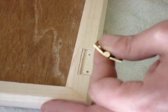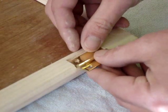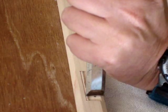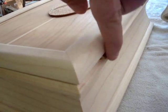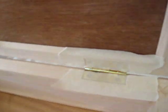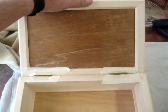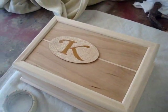I decided to revisit these hinges and see if I can make them work. What I'm doing is carving them out a little bit deeper inside so that they'll fit in like so — I think that might give me a better chance to have the lid stay open rather than flopping back. These hinges really should be flush with the back and they were sticking out too far, and that was what was creating the problem. Right now I've just got the hinges taped in there and I want to make sure it's going to work. It'll stop right about at that point — so that's good. But that means I just have to fill up those screw holes I made before and drill some new ones.